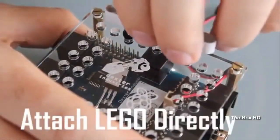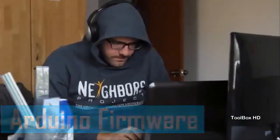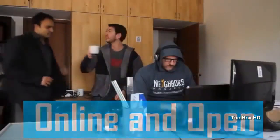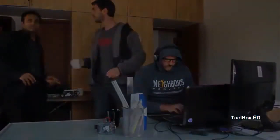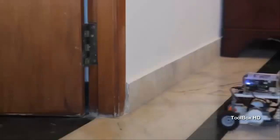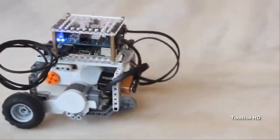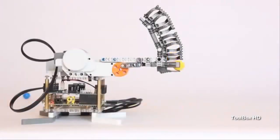We designed a sturdy case with holes that snap Legos in and can be used to build a robot around it. The BrickPi is totally open source and totally hackable. Firmware is simple and is written in Arduino so modifying it is easy. All of the designs for hardware and software are kept online and open. To use it: slide the BrickPi onto your Raspberry Pi, attach a 9-volt battery, hook up your Lego motors and sensors, start by loading one of our example programs, and let your robot run free. Then start modding and hacking. Programming it is easy — we've already written libraries so you can write something easily in Python. All of the motors, sensors, and other peripherals can be called with a single line of code from our library.